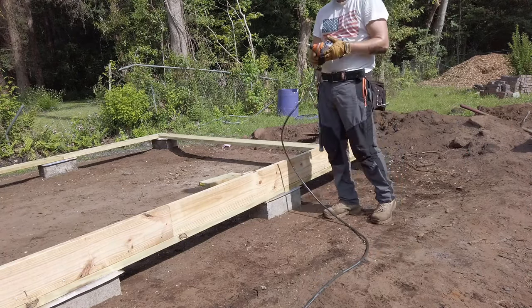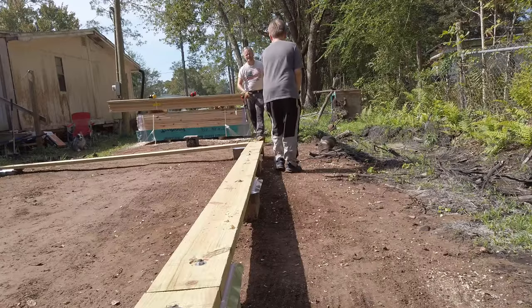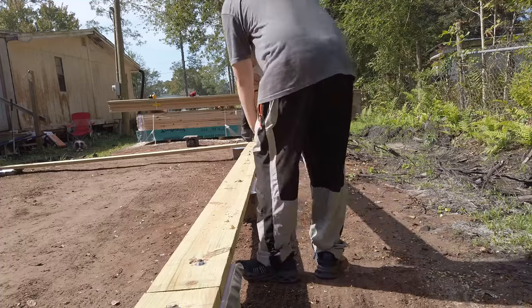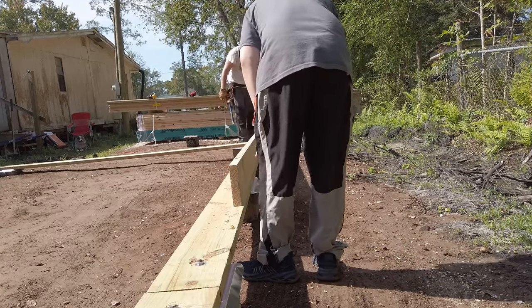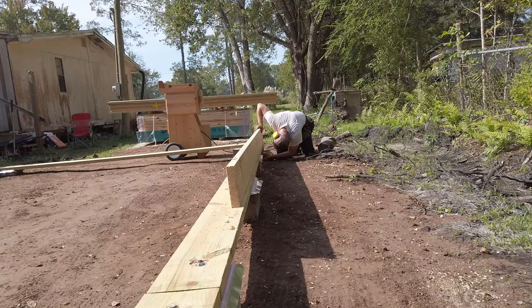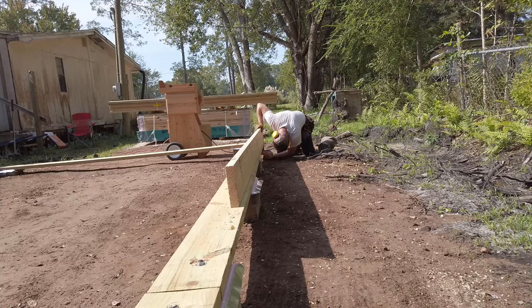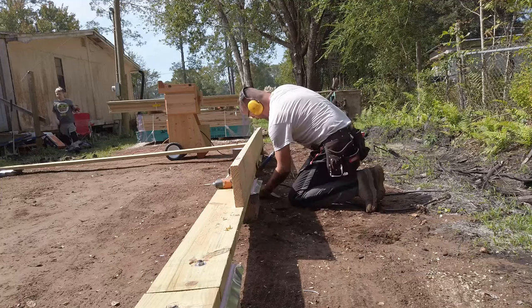Also, keep in mind that this is an edited video. I'm not gonna show every nail being driven because, well, that would be boring and stupid. But for reference, I went every 8 inches or so and I did a combination of face nailing and toe nailing. There is code on all this and codes change based on where you live. In my area, we use the IRC, which is the International Residential Code with no overlays.